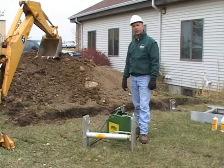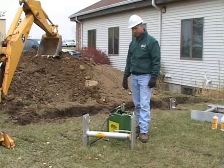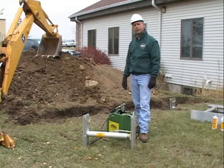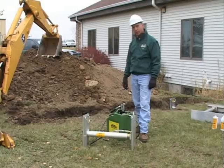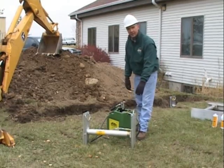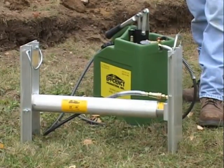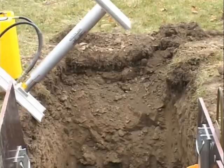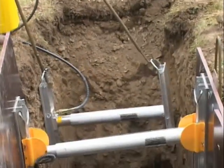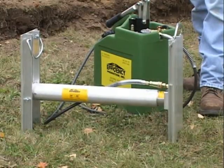One of the things you may encounter on your project are trenches that have cross utilities running through them, making it very difficult to use conventional trench boxes that you need to push and pull to grade. That's where hydraulic vertical shores come into play. This is an example of a spot shore — a single shore. Use this shore around that cross utility until you get beyond it, where you can pick back up with the steel shields or conventional hydraulic shoring. Make sure to check your tabulated data for proper positioning in the trench.